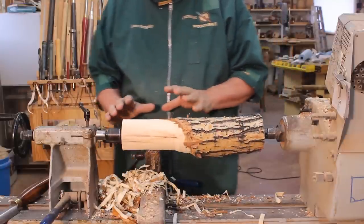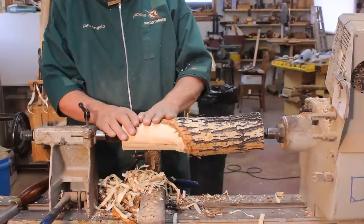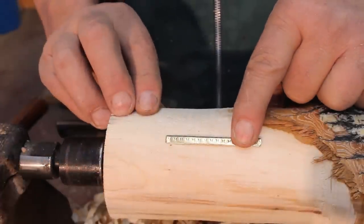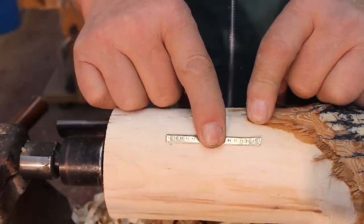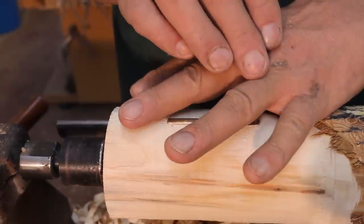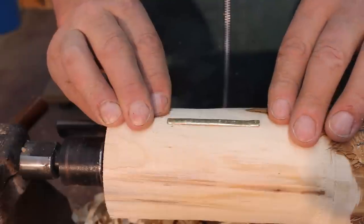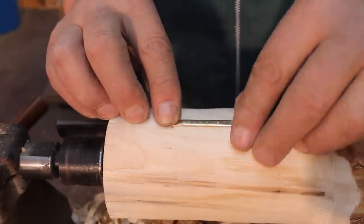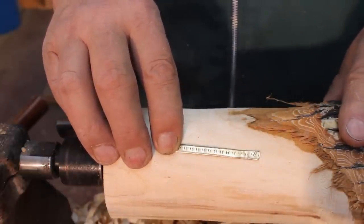Changing hands allowed me to go to the side and have the shavings go in that direction or the other, depending on which hand I'm turning. Let me leave you with one final thought. This little strip of metal I'm showing you used to be round — it used to be my wedding band. I wore that for 30 or 35 years. I was coring some wood and a bowl blank came off and landed on my ring finger and smashed this wedding band, which is now just flat. It's not a good idea to wear rings — you can lose a finger and bad things can happen. You never know when an accident is going to happen. Safety is anticipating those situations where something bad can happen, and not doing them. Use a different tool.